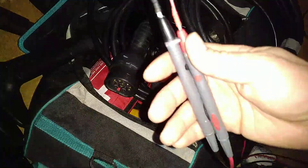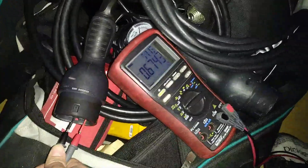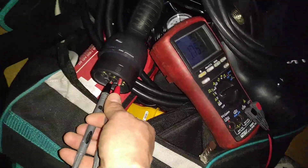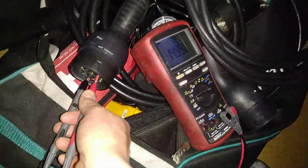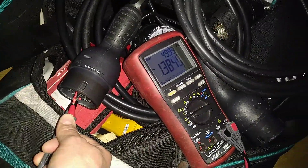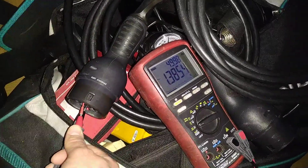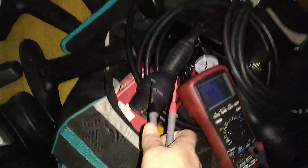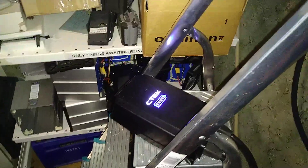This one was just repaired, and I want you to take a look at the voltage we get between ground and line 1 — there's nothing there. Line 2, a little bit of leakage, 1.5 volts — should be nothing, but it's not too bad. Live to line 2: 1.38 volts. Line 3: another 1.5 volts. So this thing has a bit of leakage from the plug to the EV connector. That's not good, but it's just a couple of volts, it's not gonna kill anybody.